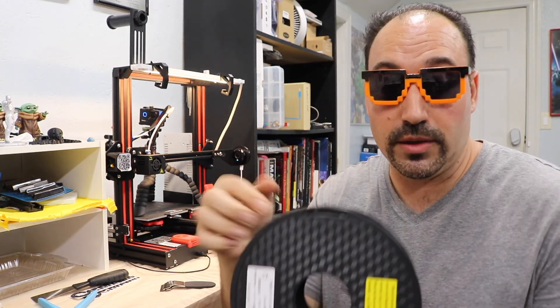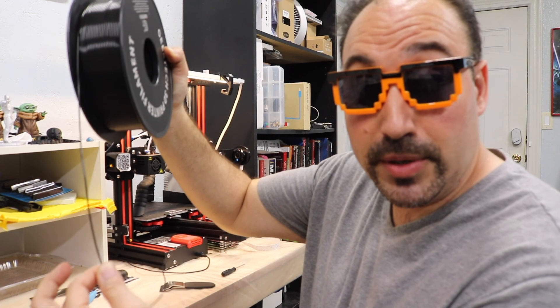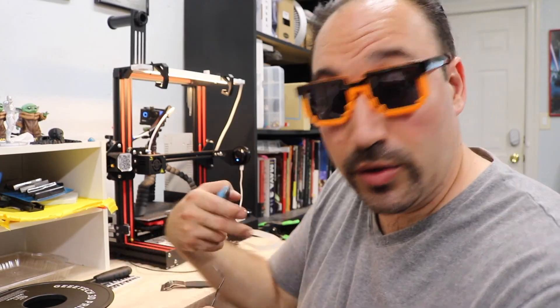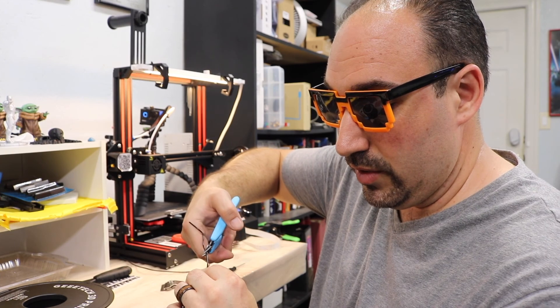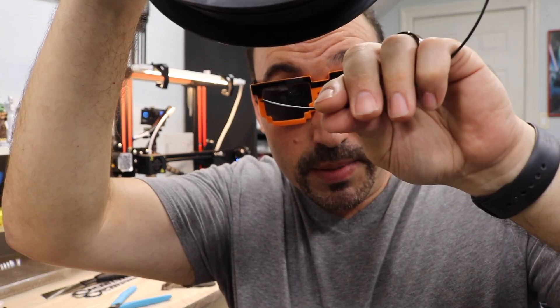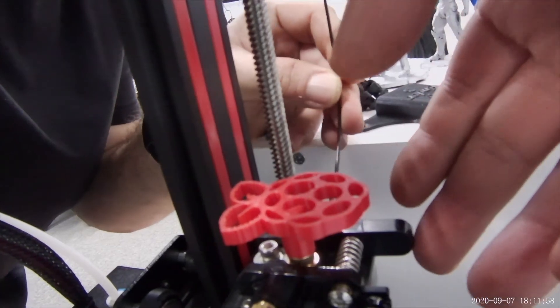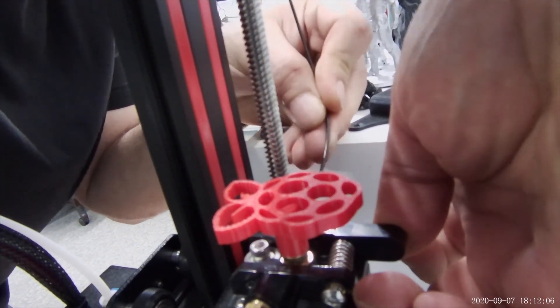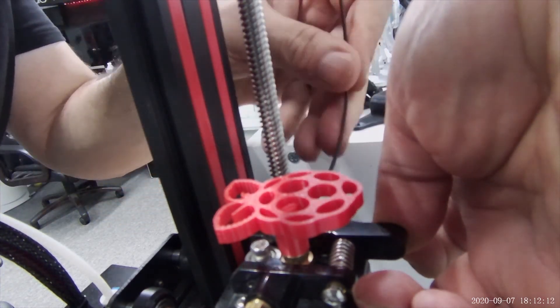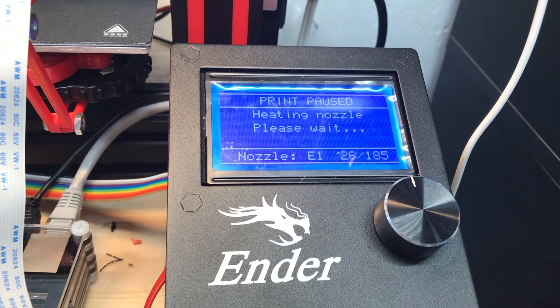You don't want to tangle it — grab the end and make sure you hang on to it. Before we stick it up on the spool holder, I want to show you this: you want to hold it the way it's going to be on the printer, and we're going to snip it a certain way. The curve that goes in — you want to cut it at the angle that it's curving into you, almost like a needle point. This is the way it's going to be on the printer. We want it at an angle so we can easily feed it in. Put the spool right up here, take this end, slide it in, hold down, slide it right in, push it all the way in until it can't be pushed anymore, and then press the button to continue changing the filament.